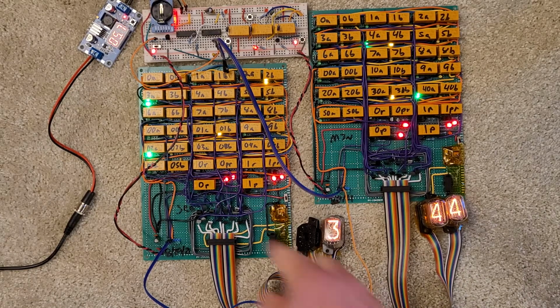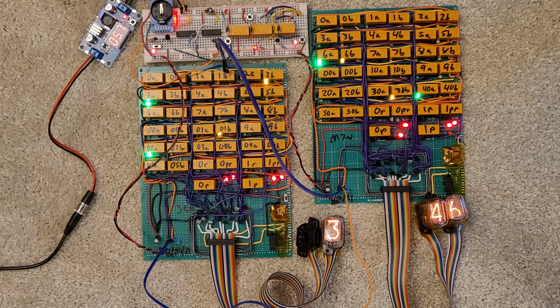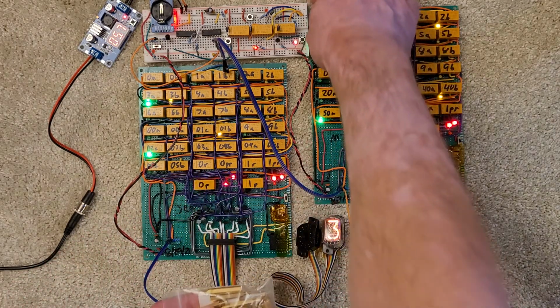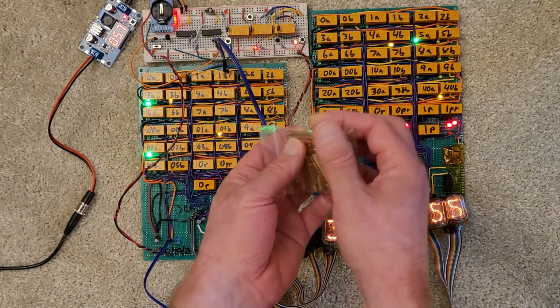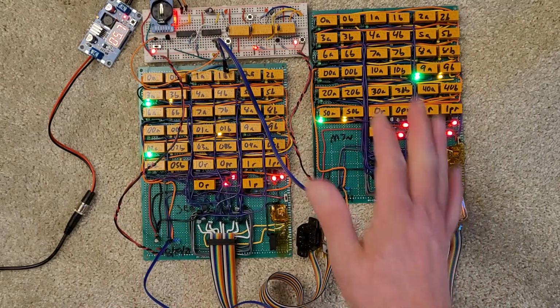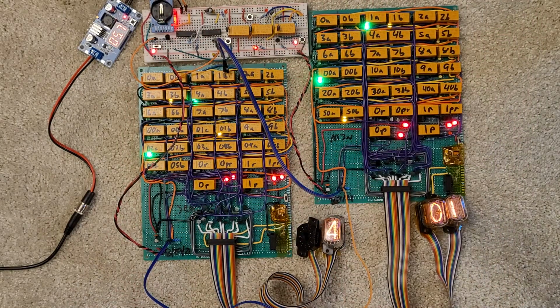And then these boards, I'm going to have standoffs. And so in the chassis, there'll be a board on the bottom. There'll be these brass standoffs. You screw those in, put the next board on it, more standoffs. And so all 4 boards will be stacked up.